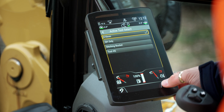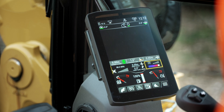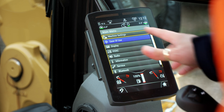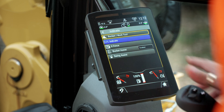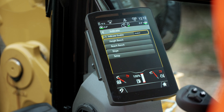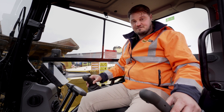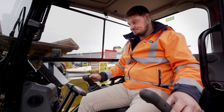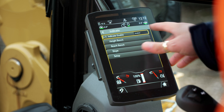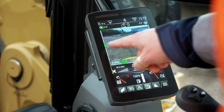Then back into our menu, I'm going to go on to ease of use, then indicate grade. Indicate is an indicate-only system — a basic grade system — so we can select our benchmark, add offsets above or below ground, and we can also add slopes. Indicate is enabled and turned on, so you can see the light bars.